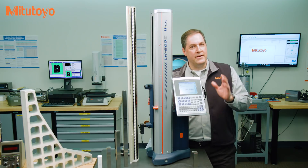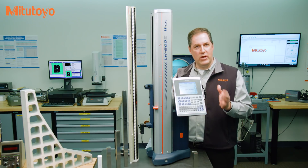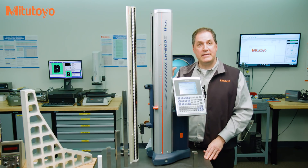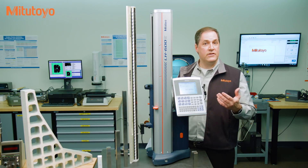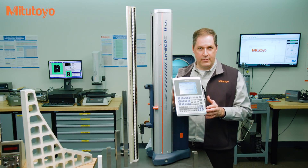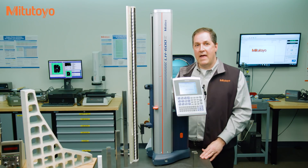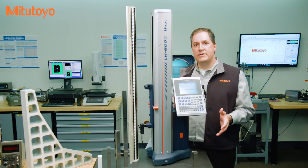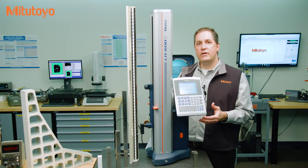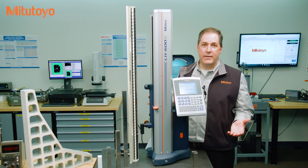Now let's discuss the most controversial use of the term calibration. There are times when measuring equipment needs to be adjusted, corrected, tweaked, or compensated to make it more accurate — possibly to bring it back within specified tolerances. These adjustments, as important as they are, do not meet the official definition of calibration. In our experience here at the Metrology Training Lab, a majority of organizations will claim that in their opinion calibration includes proper adjustments and that measuring equipment isn't truly calibrated unless it has been demonstrated to be working within tolerance. So this is a big problem in the calibration business.